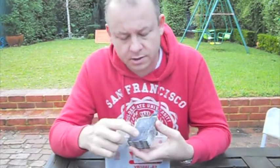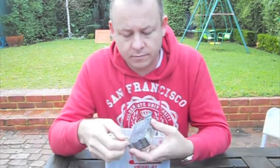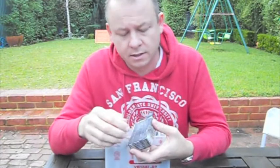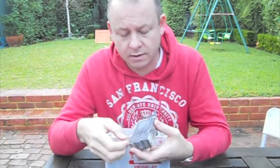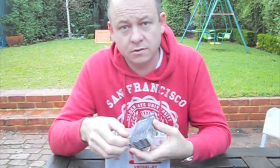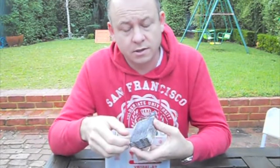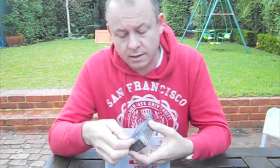Here's the front plate. This is usually a structure of lead filled with lead oxide paste. And other versions of this would be actually lead plate rather than just a structure filled with the lead paste. The idea with the lead paste and the fine structure is first of all to reduce weight, secondly is to increase surface area, which means that you can actually deliver higher current levels if needed, like starting a car. The disadvantage is that they don't last as well, and they also don't tend to be able to do a deep discharge. They tend to discharge to about 10.5 volts, and if you continue discharging below that level, they are not retrievable as a battery.